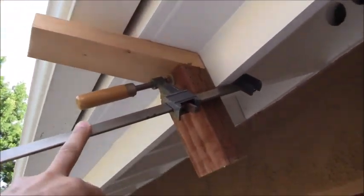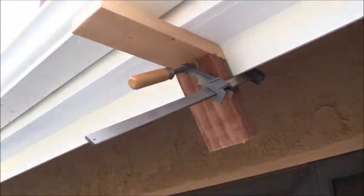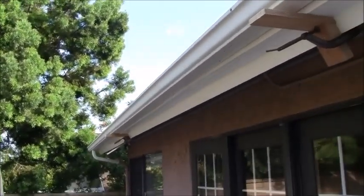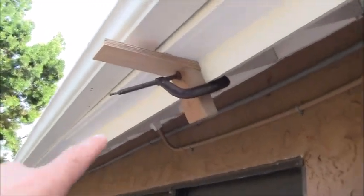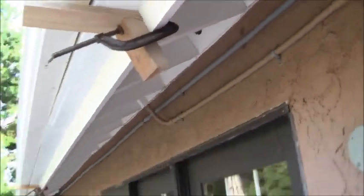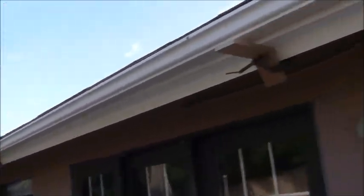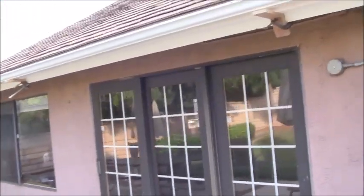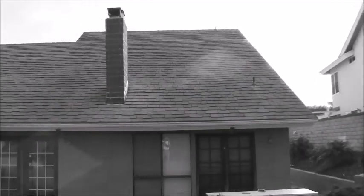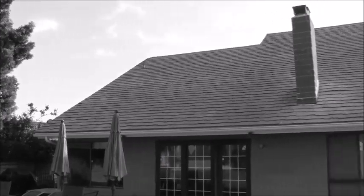This is how I was able to hold it down and work with the gutter without feeling stressed. I built this shim support system to work with the angled fascia, and I have the same thing for the other side. But the gutter here is fully installed. The sun makes it a little hard to see, but it's a nice straight line pitched all the way toward the downspout.